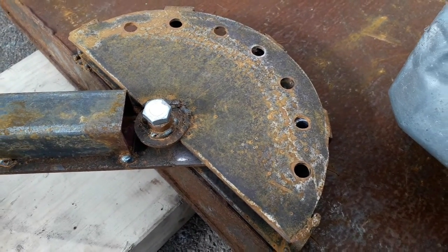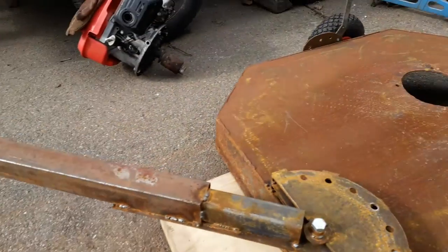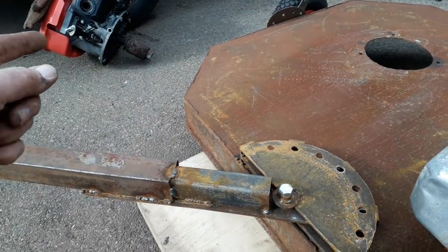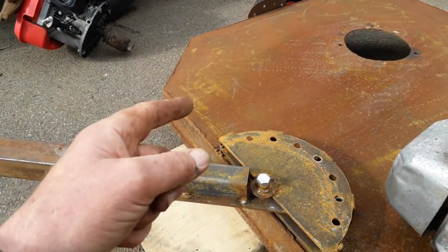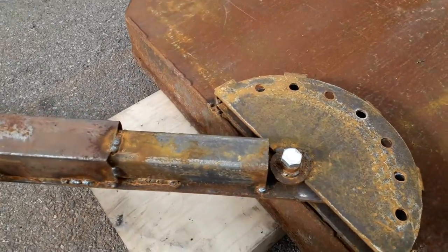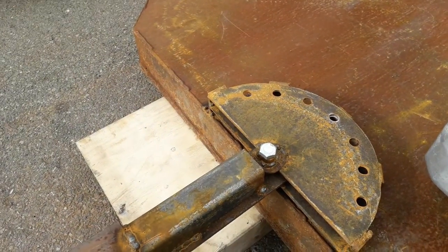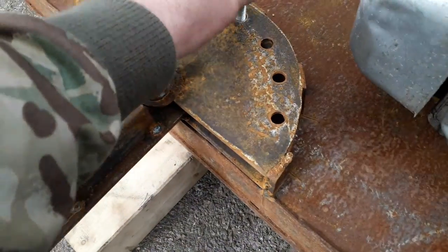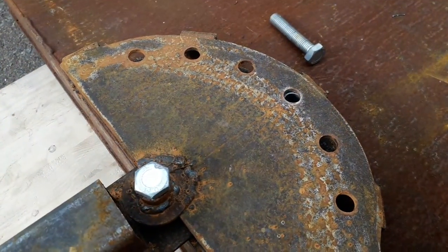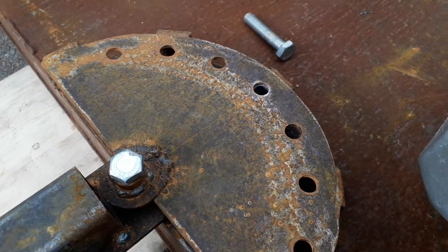And then how far you want it to go off under the trees you move it over. It should run just overlapping the deck on the tractor - I've got 42 inches on the tractor and 42 inches on here, so with the overlap I'll be doing an 84 inch cut. I've just got to do a little bit of moving out and down in there, so I need to put a bit of tube top and bottom to hold that central.